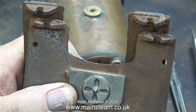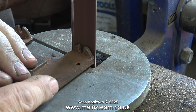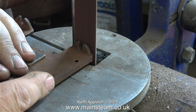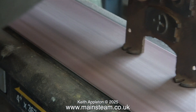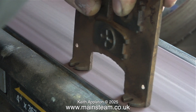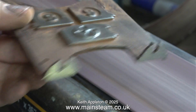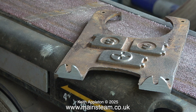What I'm about to show looks very easy to do, and it is if you've had a lot of practice. I started the job using the one-inch belt sander to remove the protrusions from underneath the feet. There is however a much easier way involving a four-inch belt sander — the problem is you only get this wrong once. I've done this job so many times on so many different pieces of metal that I instinctively know how to hold the part so only the protrusions are removed and not the feet, which are thin enough to start with.